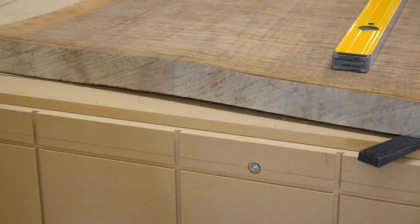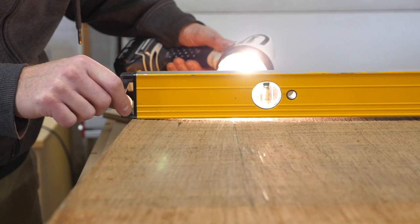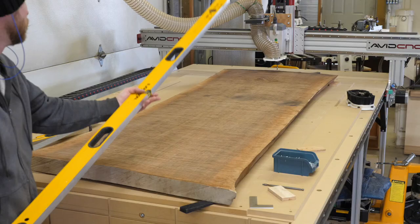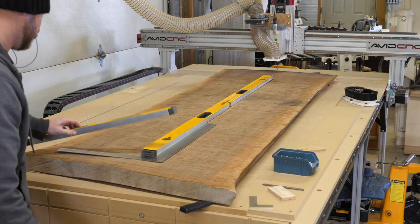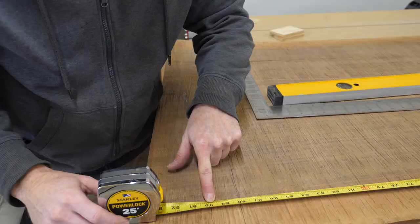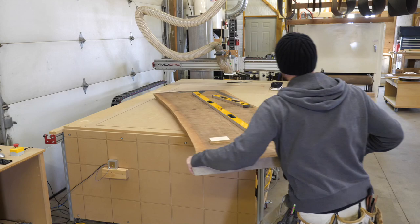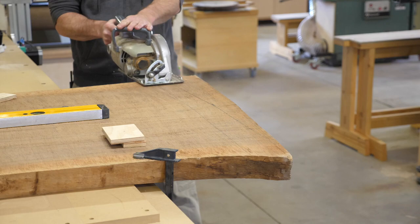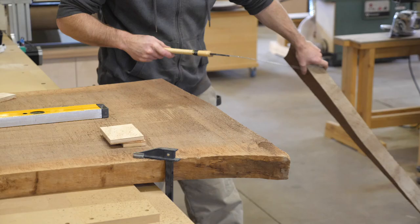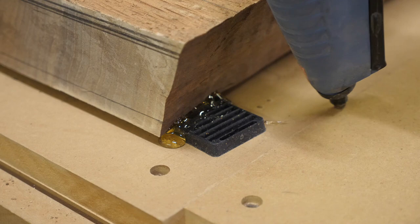I set the slab on my CNC and assess the surface to figure out exactly how to position it to get it flat but leave it as thick as possible. I notice that at one end there's a pretty big lip, which messes up my ability to measure. So I establish a centerline with a level, then mark a perpendicular line to help guide my cut. I check my line relative to the other end cut and I'm within about a quarter of an inch — these aren't final cuts, so that's close enough. Once the end has been cut, I measure and mark exactly where the CNC will need to cut down to achieve a flat surface. As I'm gluing down a shim, you can see various marks on the end grain where I've played around with shim combinations to give me the best yield.